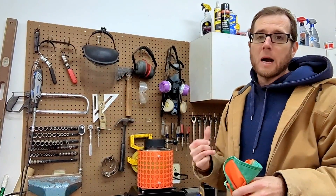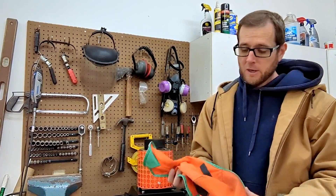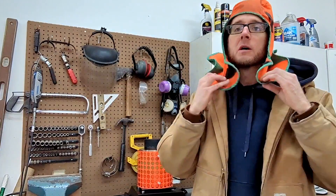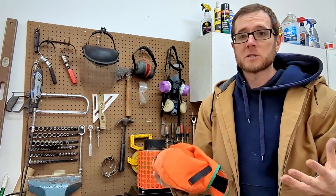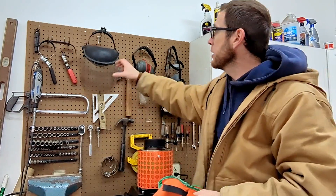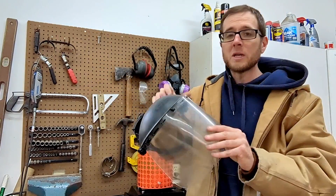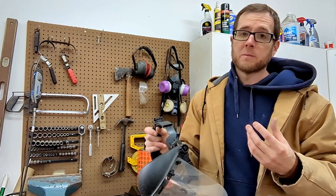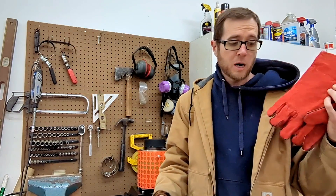I got four copper casts done, but I want to mention: always wear personal protective equipment. I wear a hat that goes over my head and around my neck made of Kevlar, to protect my neck and the top of my head from any splatters. You saw there were a splatter or two. I also wear a Carhartt jacket, and you always want to make sure you're wearing a face shield — not just little goggles. If you get a splatter of molten copper on your face, you're in for some trouble. Definitely wear more protective equipment than just the gloves that come with the furnace.